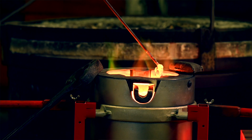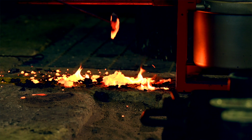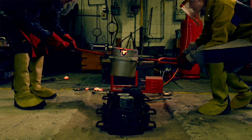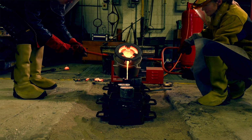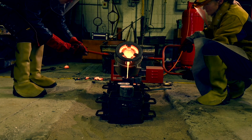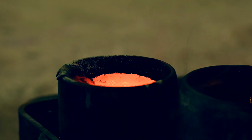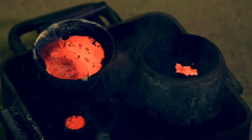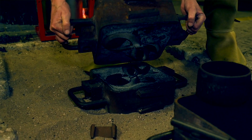I know the sort of shape and size that it should be, and that's not just because it's a nice size to handle and to put on your mantelpiece, but also it fits very well into the casting process, where we have these boxes that we mold the sand in. So the sand casting process, I love it because there's no waste. You use the sand over and over again. And the reason it's black is it's been used so many times. It's been touched by 1200 degree metal and basically burnt.